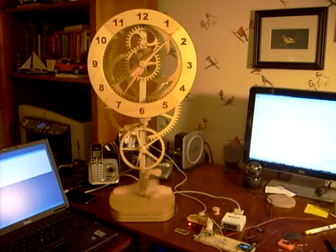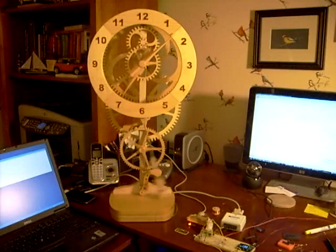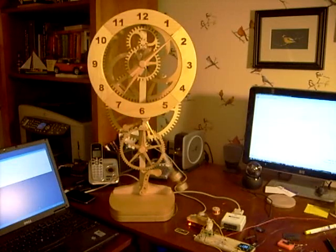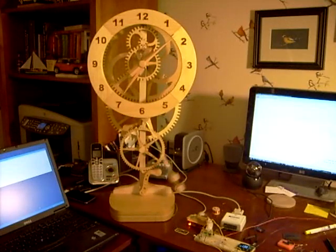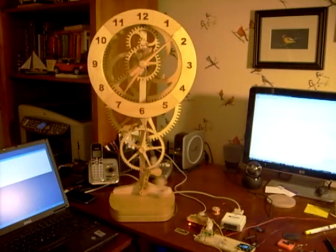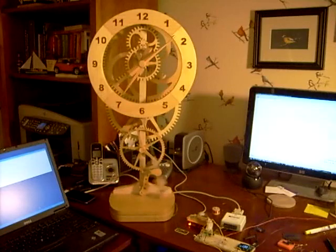With this control circuit it's quite different. You really don't have to set the pendulum at all — you just start the clock up and let it run, and the control circuit takes over and will keep near-perfect time. I've had this breadboard running for almost three days now with no perceptible error in the clock reading. I believe it's actually accurate to within a second a day, as accurate as the watch crystal time base of the microcontroller can be.